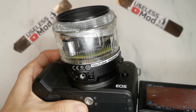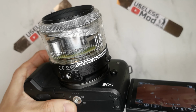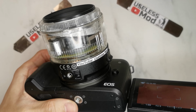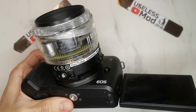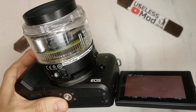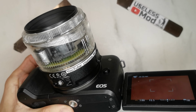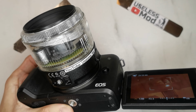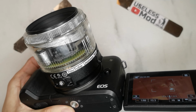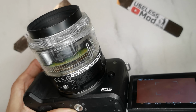Second test. This time you can see more clearly how the motor and gear push the lens. Top right corner is the real perspective of the camera. I put my hand in front of the lens to block the view to make it refocus. You see the screen black out because the IR sensor is triggered by hitting the table, which makes the camera think I'm looking at the viewfinder. So it's completely normal. In this test, you can see the camera really can focus, although there is some play between the focus ring and the main body, but it didn't affect its function.